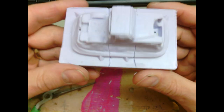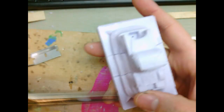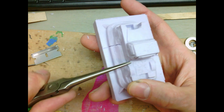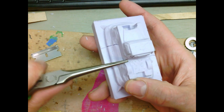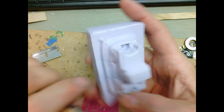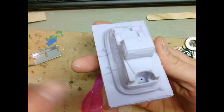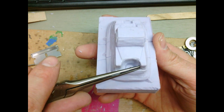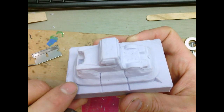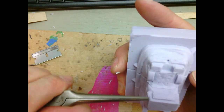I'm squaring it out. This is pretty much ready - I'm looking it over for any other little things that might be issues. One thing I noticed is there's a real thin little piece of rubber here. Those little thin rubber pieces are going to create a texture on the inside, so let's get rid of those little strappy pieces. Anything that looks like it might cause issues - you see the little strips hanging off, little flaps - those can catch the plastic and cause weak spots.